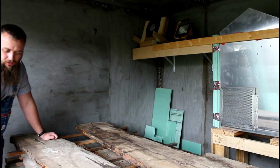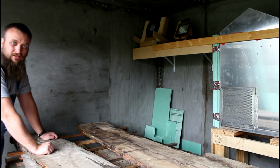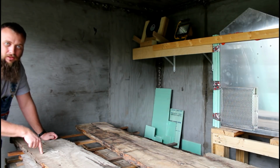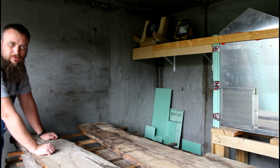This barn wood here, like I said, is about 9% moisture content. Once it dries down, it'd get to probably 6 or 7. The main reason it's in here is just for the sterilization process to kill the bugs in it. Maple on top is about 15. It will easily go down to 8%. 1-inch walnut boards on the very bottom, they're at 14% this morning. They'll have no trouble getting down there either.